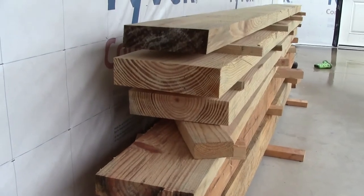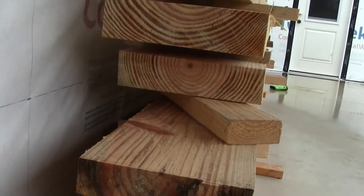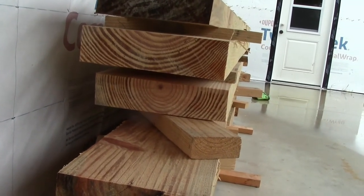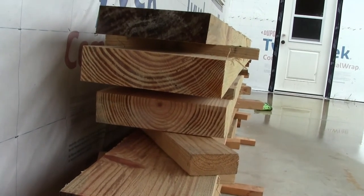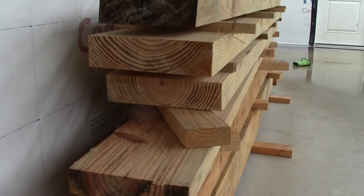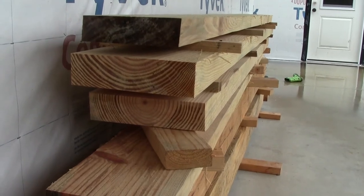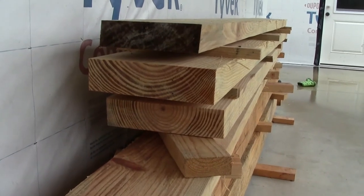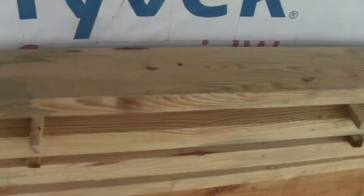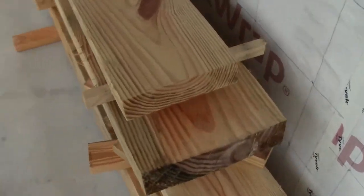And when I got down to the center pith, or usually the center parts of the logs, you can see some of the centers right there. Instead of trying to make those one bys, I would just sort of leave whatever was left over. So I kind of flipped the log over, ran down one side, got pretty close to the middle or so, and then flipped the log over and worked my way down. But once it gets to about a 2-inch piece, I just sort of left them. I thought these would make really nice benches or something. They're actually pretty heavy, and they're either 8-inch wide or 10-inch wide, depending on the logs.